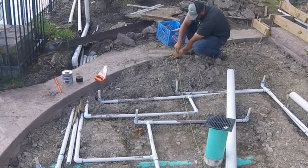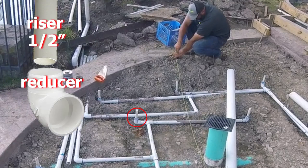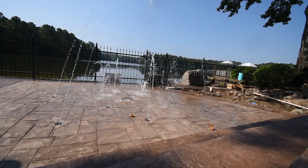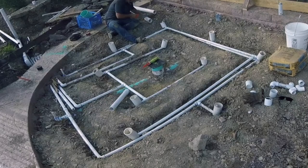When setting our nozzles, we use a one-inch to half-inch reducer because the line feeding into the nozzles is half-inch. The reason we use one-inch schedule 40 PVC is so that we have more water volume for each zone. We've found that four heads per zone gives very good water volume when working with one-inch PVC.